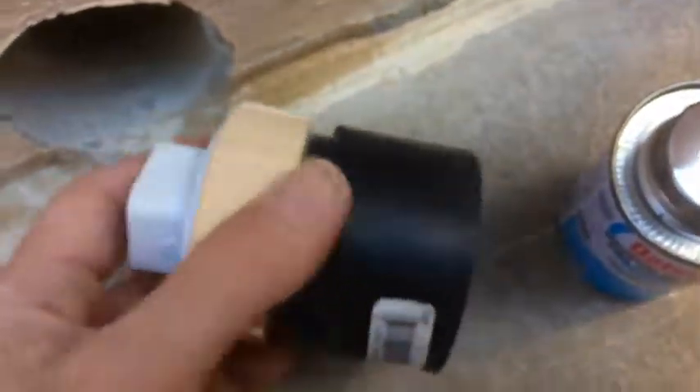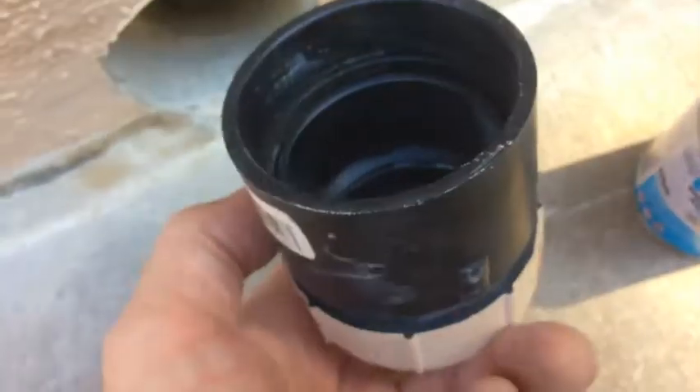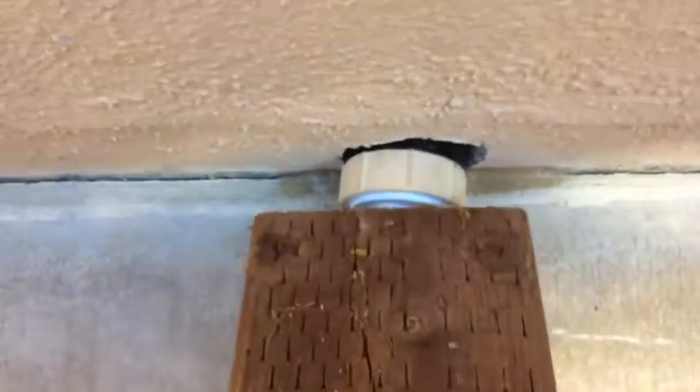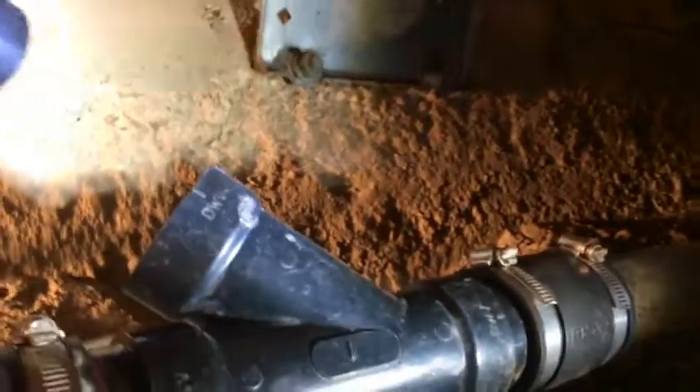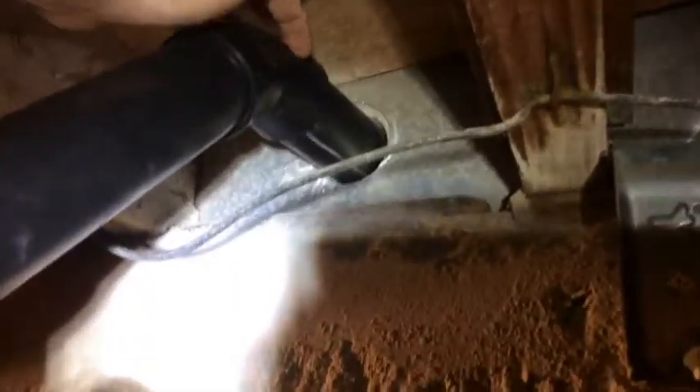Now the trick is to glue this together using the ABS glue — take this apart and glue both sides. You've got to be a little strategic when you glue this up. I decided the best way is to get this piece first — that's all glued up. Then I've got this nice 4x4 or 4x6 which I brought over — end it up against the fence over here, really push on it so it won't push off. So here's our piece sticking out with the piece of wood against it, and over here this is still allowed to move. Then next we'll fit in this piece — it makes sense to glue this piece first because I can still rotate the shaft a little bit even though that piece of wood is holding it.